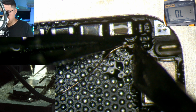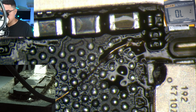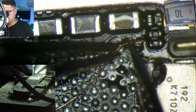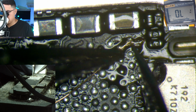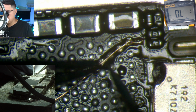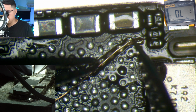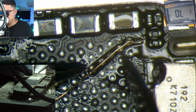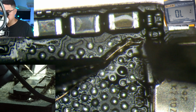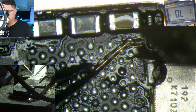All right, so I got that soldered on. Now I got to line up. Oops, I got some solder on the crystal here. Oscillator, I don't know what it is. Looks like a crystal. All right, so basically these two ground pads are solid ground. These two are the ones that are weak or disconnected. So I could technically just run these two right here, but if I run across all of them, it kind of creates a stable connection, it holds the jumper in place also.